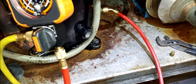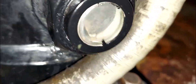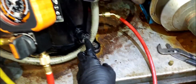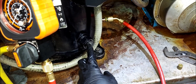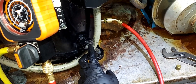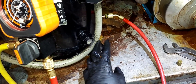When you're adding the oil, you can see that the oil level is really low right now, so you want to add it until it's halfway or 75 percent of the sight glass. So fill it anywhere between 50 percent and 75 percent of the viewing sight glass level — that's enough, and that's typically true for all compressors.